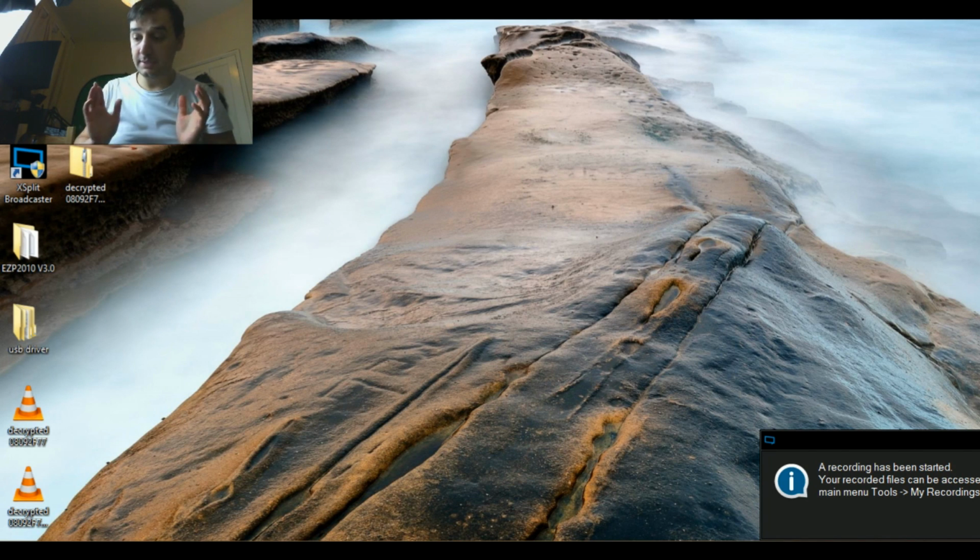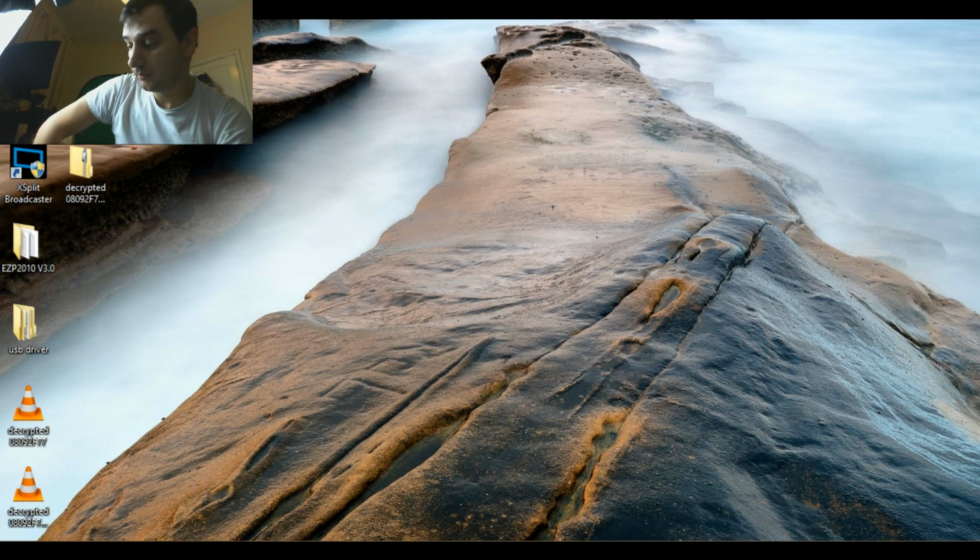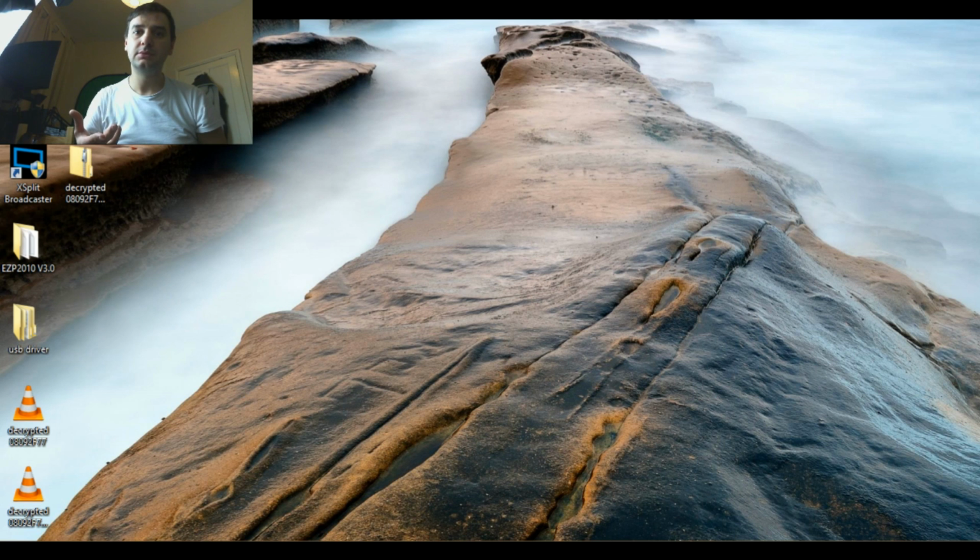Alright, so I'm here with the HP 15 that I tried to fix a couple of weeks ago. I opened it and I had some problems with it. I had no power on the notebook. It didn't power, though the lights did come up. You can actually see the light is coming on, but it didn't trigger the sequence from the BIOS, so it can power up. Now, what I had done here is that I refreshed the BIOS.